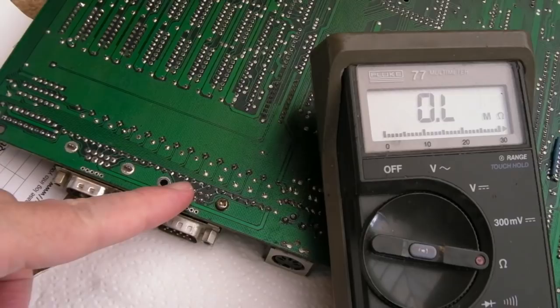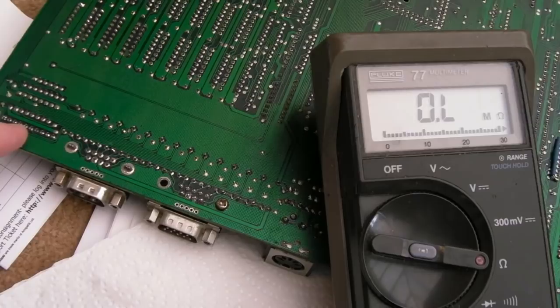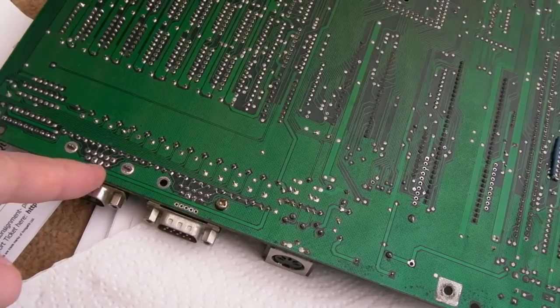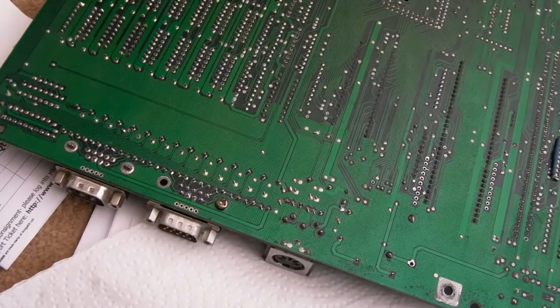Because although we did see a change and we got the resistor pack off, we still had one lot of resistance, so maybe some corrosion here as well. I don't know. It's another one of these. I'm not 100% sure on the issue with both ports here, because you think, how would this port interfere with that port? I'll have a look at the schematics in a minute. Maybe the H and V joined together. I don't think they are. I think they've got separate pins on the 157 there, so, I don't know. They're always strange when you get problems like this on ports on these.